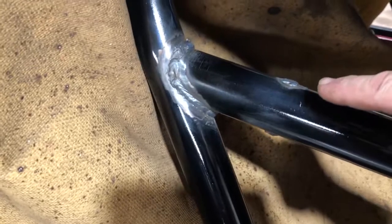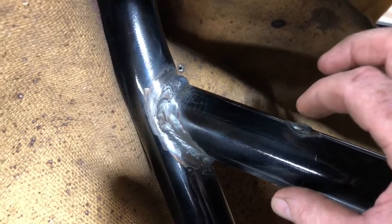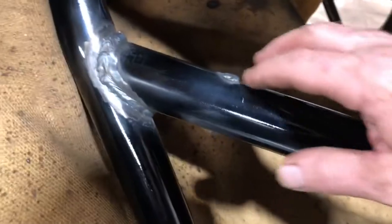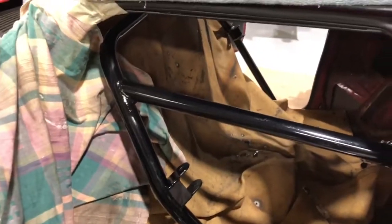Here's the rear support fully welded all the way around — that's where the bolt hole was. What I did is I backed the bolt out until the front edge was flush and then I cut the bolt off, so the bolt is actually still in there and I just plug welded both ends — fastest way around that. I'll just dress that down and paint it while it's in this forward position, because once I slide this back up inside the car it'll be real hard to do. The way it's sitting right now it's a piece of cake.